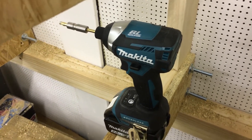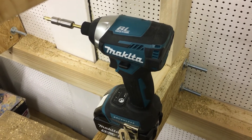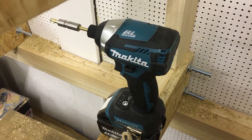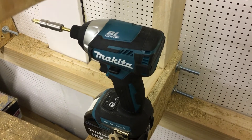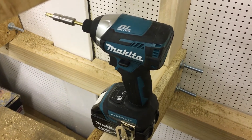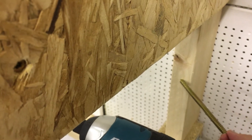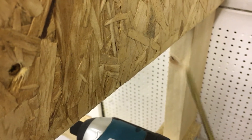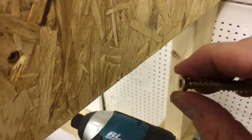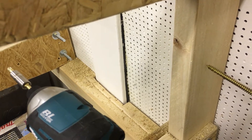The technical addendum is basically this tool — it's a fantastic purchase. I knew about impact drivers but never really had one before. They make an enormous difference, especially when driving into brick. The technique was: I pre-drilled an 8mm hole through the wood to accept the screw, then a slightly bigger hole — maybe 10mm — for the head clearance. So I'd end up with a 10mm hole halfway through, and then the final pass was an 8mm hole to accept the screw.